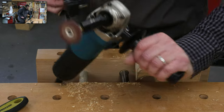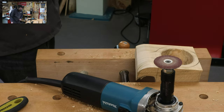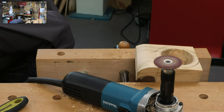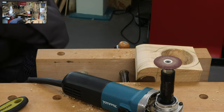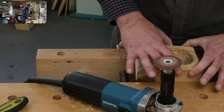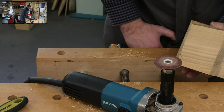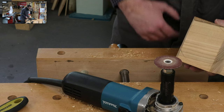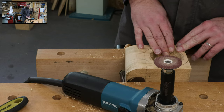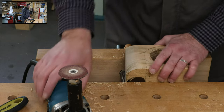As long as they've got that nice smooth round, this is going to do a great job of blending and finishing the inside of this cup. And we're doing all of this while we've still got our bits here that fit around the rim nicely, because we're going to have to shape the outside soon. So make sure you finish your bowl to the point that you're happy with it before you start shaping the outside.